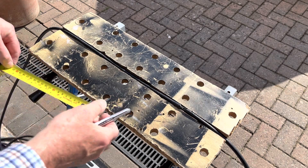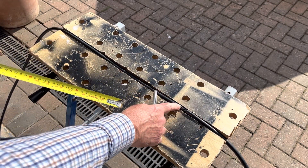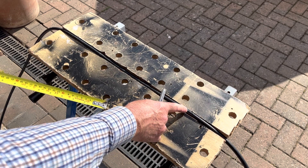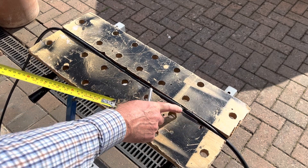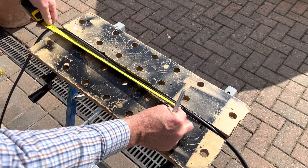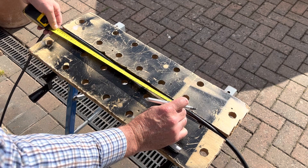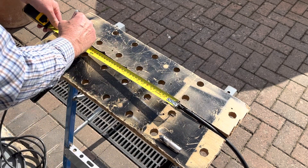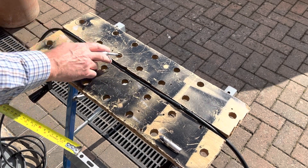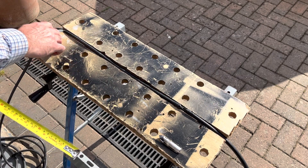Effectively I need another 440mm length from the edge of the center break — so 440mm that way, 20mm gap, and 440mm that way. I'll mark that up with a pen. Edge of that loop — 440mm is there, same distance as the other end, and that's where I need to make the break to solder that end onto here.